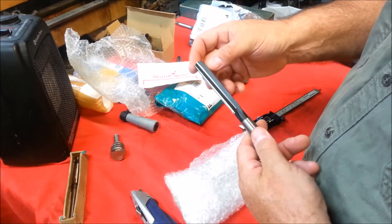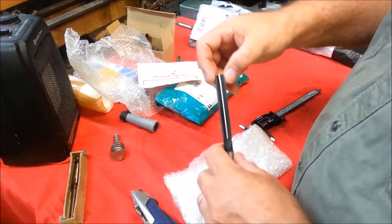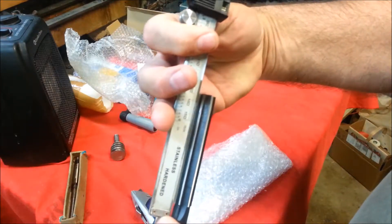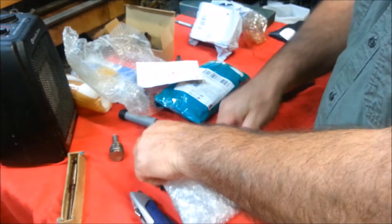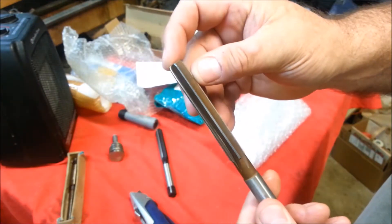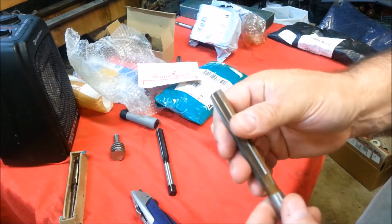A lot of these import reamers, I've noticed, they don't have a radius here on the tip. It does have a little tapered area here — looks like it's about a millimeter smaller on the tip, which lets you lead it into the hole. There's one with a rounded, a little more rounded tip, but it's actually kind of beveled. These look okay. They feel nice and sharp.